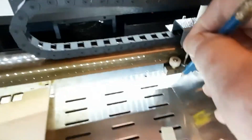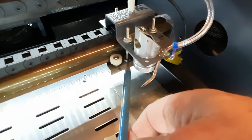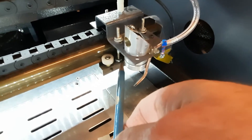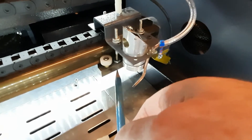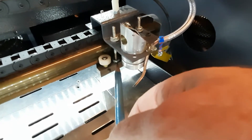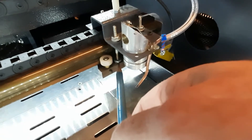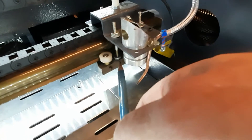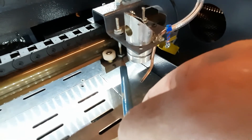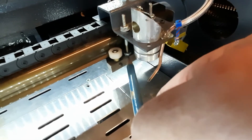You can see what I've done — the bolt is threaded through the bottom plate and has a nut screwed down to pinch that bolt to the plate. When you get the bolt almost all the way screwed in, put a drop of red Loctite or thread locker on there. It has to be red, because that indicates it's intended for a permanent installation — blue is for temporary. You want this to stay as snug and immovable as possible. Put a drop of red on there, screw the bolt the rest of the way in, run the nut down, and tighten it to the plate to create a very solid installation.